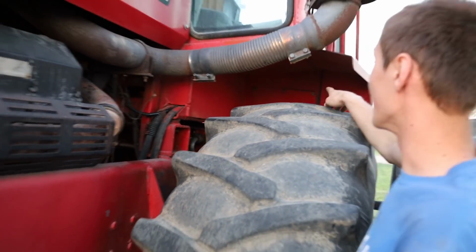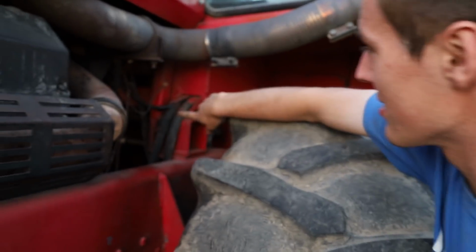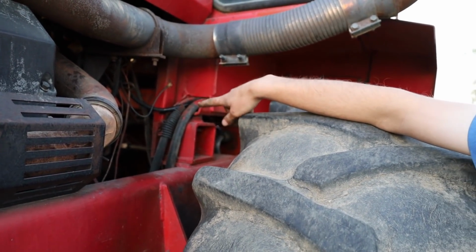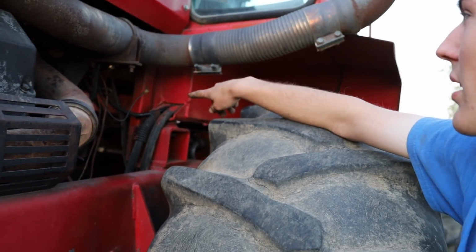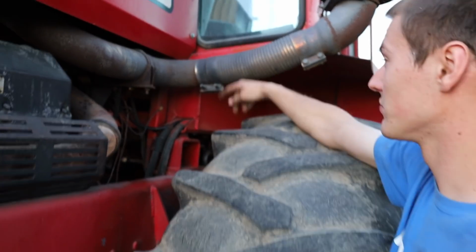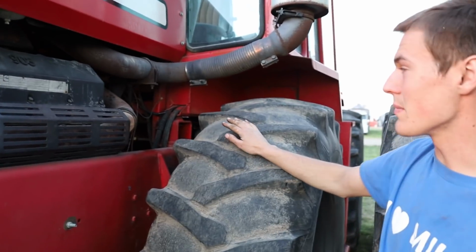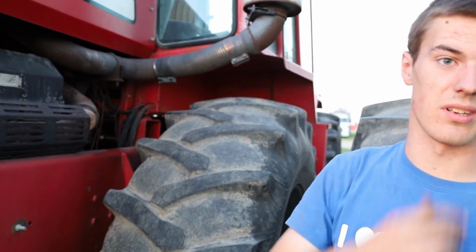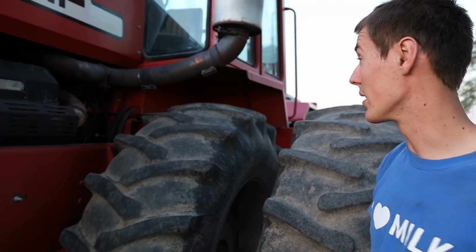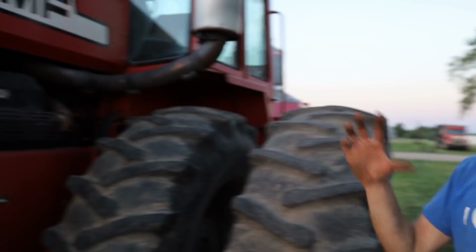But anyways, we pulled a new snake back from that panel here. That's this guy here, just a new sheathing. It's got 3 wires in it, and we ran that up to the connector. So we replaced this section. There wasn't much damage outside of the cab. Most of the damage happened in the actual dash. Only 1 or 2 wires actually got melted out here. So we just ran a new run, all in that sheathing, up to the plug, which goes through the firewall.